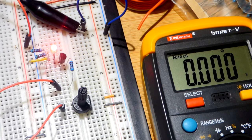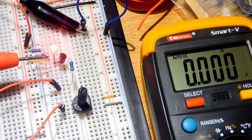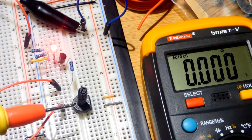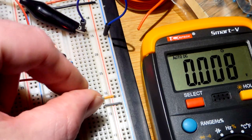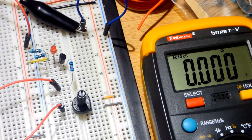Current flow is relative based on the direction of voltage across it. Hopefully that all made sense. There's a lot to this component to be studied in written form, but also with any component try to build circuits yourself based on basic principles — that will help you learn the component better. This is a component I studied quite a bit but it doesn't really make sense until you try it. This demonstration circuit shows clearly that you can cut off the transistor when you have a more negative voltage at the gate.